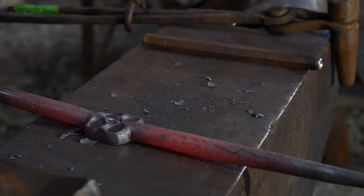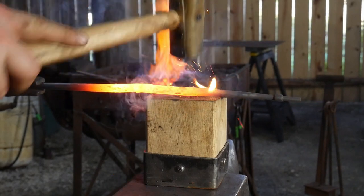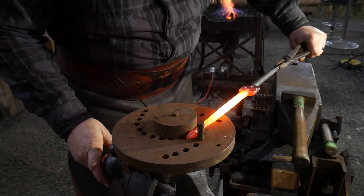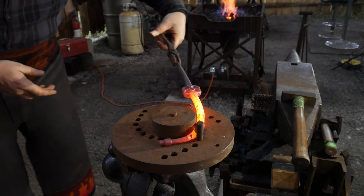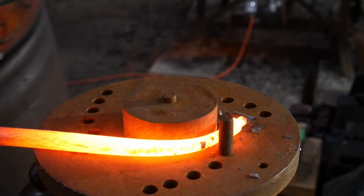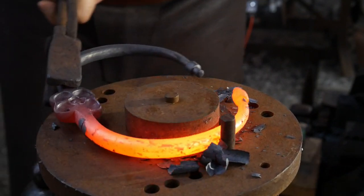In the next heat we're going to straighten this thing out because it always gets a little wonky once you do that. I'm using a wooden block from Cincinnati Forging Tool - I'll put a link in the description below - and a rawhide mallet that was given to me by a subscriber. Now I'm using a hook bending jig here, though you really don't have to use one - you could bend this around the horn of an anvil or use a pair of bending forks. I was making two of these at this time and needed both to be exactly alike, so I used the jig for that purpose.